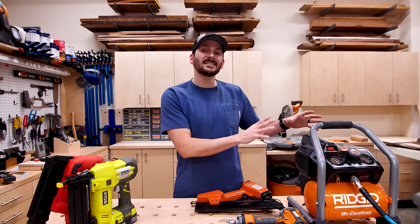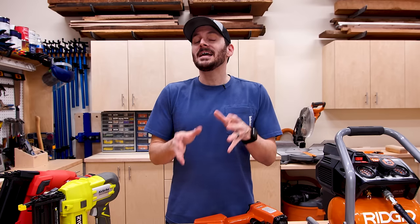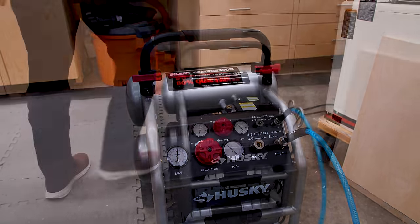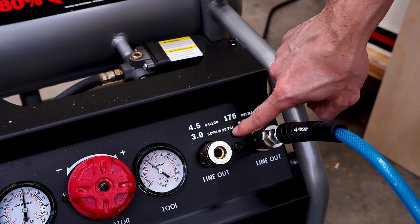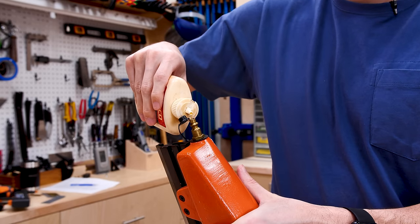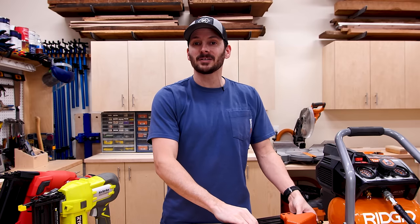The size of compressor depends on what you want to do. A one gallon compressor is very light — you can take it around and do punch-list work in different environments. But if you want to do any spraying or air tools, you'll need a much larger compressor with 60 to 80 gallon capacity, because those tools like a die grinder take a lot of air. Make sure you look at the CFM requirements — cubic feet per minute — for the types of tools you're going to buy and confirm the compressor can supply that. Also think about whether you want oil-free or oiled nailers. I've had my finish nailer for over a decade and it's not oilless — I have to add oil every time. My newer one is oilless and I don't have to add lubrication at all.